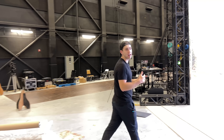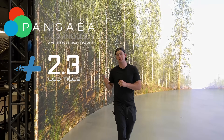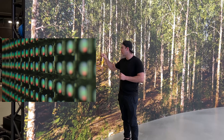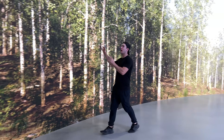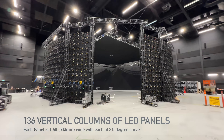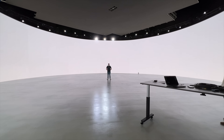Let's check out the inside of the volume. These are all Pangea panels. Each panel is 2.3 pixel pitch — that means each LED, and these are micro LED, are 2.3 millimeters away from each other. That's how dense the LEDs are. We have 136 columns in here, all the way around, and that's 75 feet in diameter. I could throw a baseball to someone over there — not that I would in a volume like this.